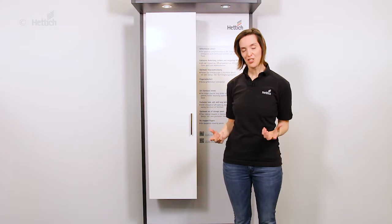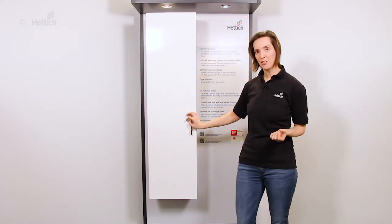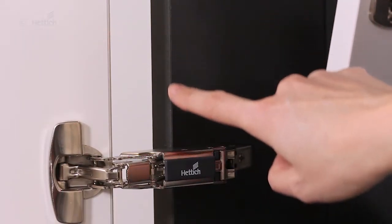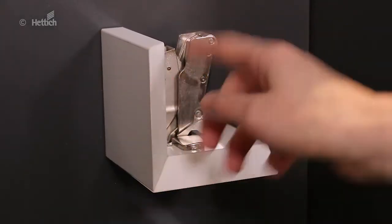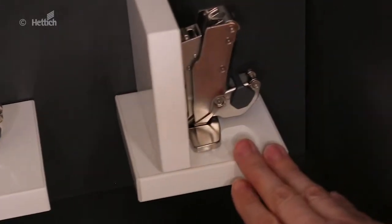With the wide-angle hinge you can set furniture trends. The special long-stroke configuration of the hinge brings the door a bit away from the cabinet while opening, and this means you can also do very special applications like mitered doors, rebated doors, or doors with a very big overlay.